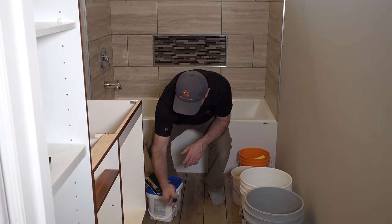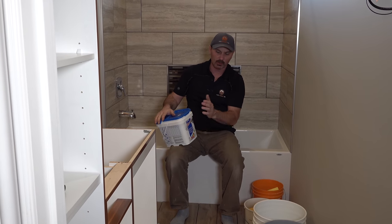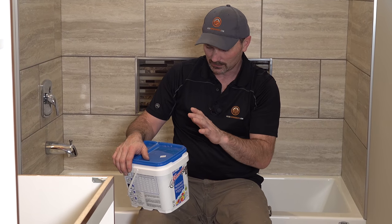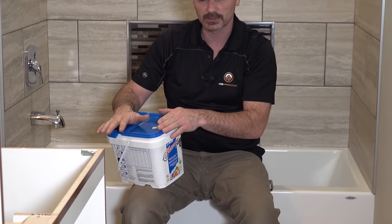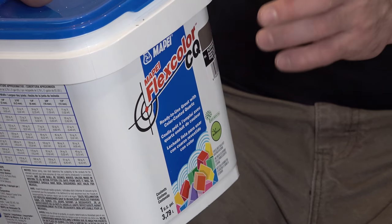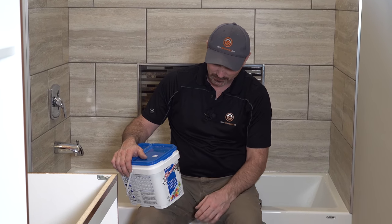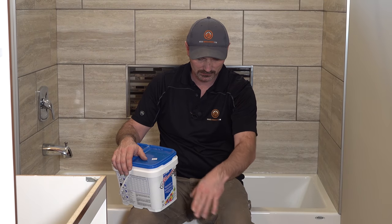So we've got that — I've already done that process and given a quick vacuum, so we'll set that to the side. Now here's my grout. We're not sponsored by this company; they didn't send us the grout, they haven't asked us to plug them. I'm using this grout because it's what I use all the time. I've never had any failures, it's pretty user friendly, and it's very good stuff. It's got a little bit of flexibility so you don't get cracked grout lines and you don't have to stain it. It's not waterproof but it's definitely better than old-type grouts where you had to seal the joints every now and again.